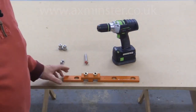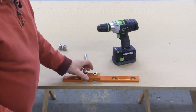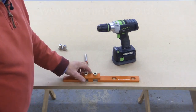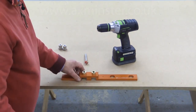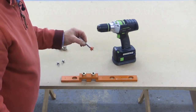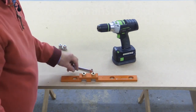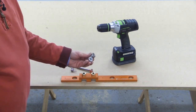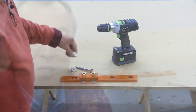We've now finished with the path sticks and all the 3mm drilling, and now we're going to move on and do the 20mm drilling — that's to enlarge the selected holes we wish to use. For this we need the 20mm guide, the 20mm drill, and at least two of the 3mm pins. We may also require, depending on the layout, a pair of the small bench dogs from Veritas. That's the end of the first part — please watch part two to see how we drill out all of the 20mm holes.